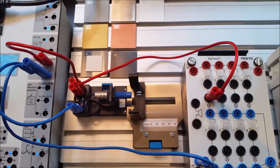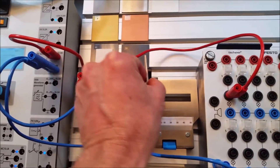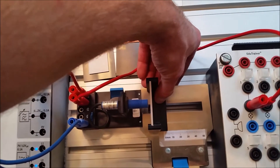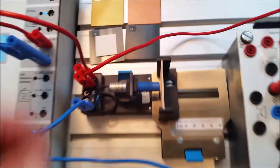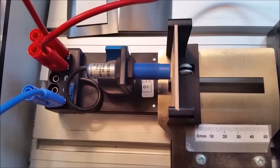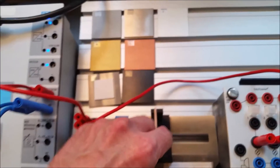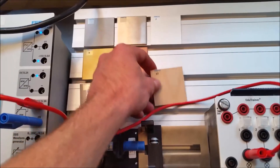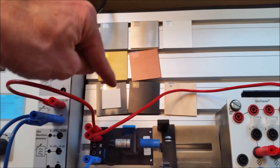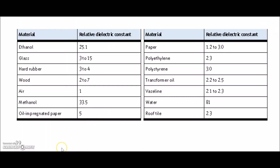Number 17 is a piece of wood — this is a dry piece of wood, which as we saw in the other video has a low dielectric. It does get picked up when jammed right up against the sensor. It looks like the wood is being picked up at about two mils away from the sensor. Again because of the low dielectric it has to be very close. To summarize: all the metals were detectable at four mils, but these non-metallic materials had to be very close due to their low dielectric values.